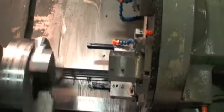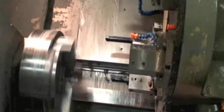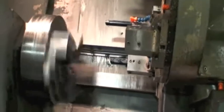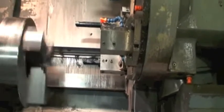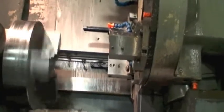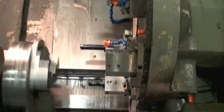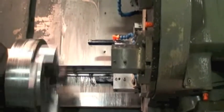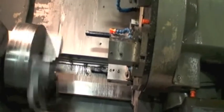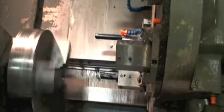If you look around at some of the other machines, you'll see the guarding is fully enclosed. We're going with a world-class environment. We're getting rid of anything that can produce mist, oil vapor, chips on the floor, like you see around the machine here. It's the older style. I mean, it works great, but it's not clean. Even the guarding isn't what we want. We want full interlocks — no option for the operator to open that door and reach in. This design didn't include that. So it works fine, it's just a matter of upgrading and conditions for your particular environment.